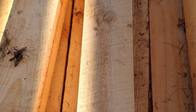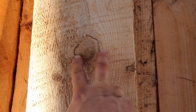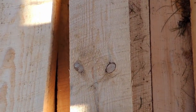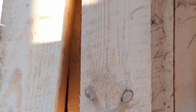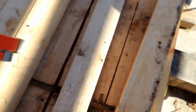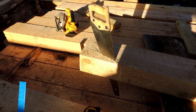There's a good example of the marks from the circle mill — it's always a big distinction when looking to see whether something was done with a band mill or a circle mill. You have those radiuses on your boards from a circle mill, whereas a band mill leaves things much smoother. When you're running a circle mill and want finished timbers, you often need to plane them because they're too rough. With a band mill, it cuts smooth enough that it's not as big a deal.